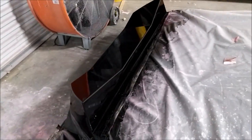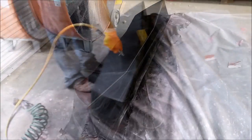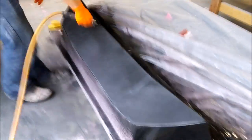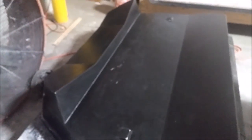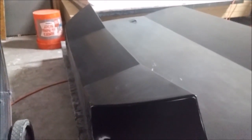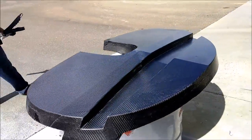Devon got on that and was wet sanding it — you can see he's about halfway through, basically got the top done, just taking the shine off. As mentioned, we won't be doing the black coat anymore, which saves us a step. We'll just be doing stuff in primer and then pulling molds directly off that, since it's sufficient for what we need. That one's done and waxed.